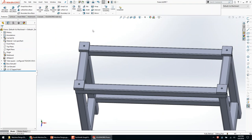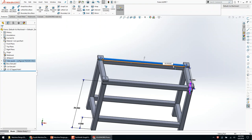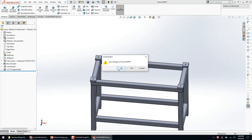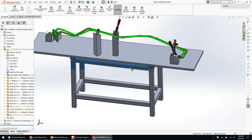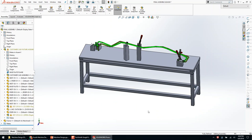What doesn't work is inside Instant 3D — you can't do algebraic equations there. You can do basic math, plus/minus/divide, but not things like 'this times that by that.' Equations are not supported in Instant 3D dimensions, so you have to have the dialog box open to accomplish that. I can also measure the outside of a pad, copy that value, double-click the dimension, add it plus that value times two in parentheses. It's easy math, but showing the point — and now I reevaluate my design.